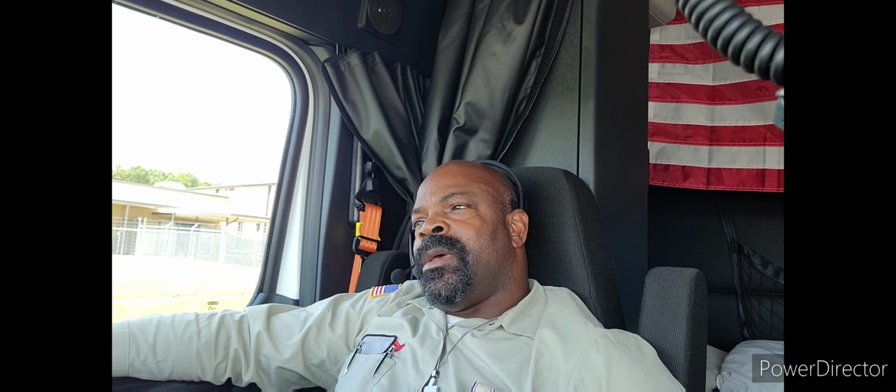So they're reworking the load. I was just telling them, if you're going to do it, go light, heavy, and then light. That way the heavy is in the middle and it'll distribute the weight out over the axles. This one is going to PA, so you can pretty much slide it back to the 48 foot mark, about 4 or 5 holes. But with the axles all the way up under there, it wasn't budging, man. It didn't change nothing and everything.